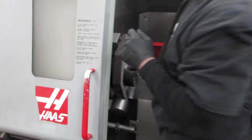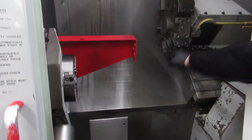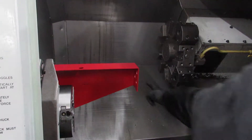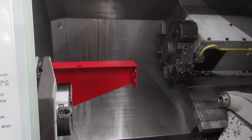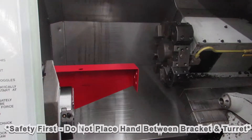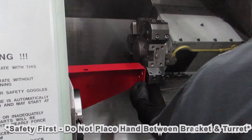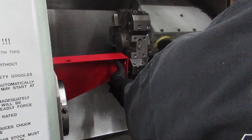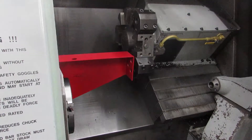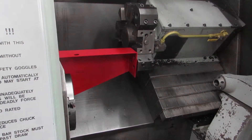Tighten down the bracket. You're going to jog your one inch or smaller boring holder into the proper position to line up with the bracket holes on the front of the bracket. I've already placed my turret where I want it, so I'm going to go ahead and bring Z over and drop the X axis down to line up with what I want. I'll bring the bracket tight enough to just give a little pressure on it.